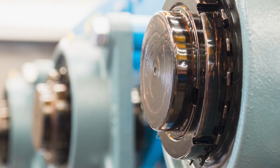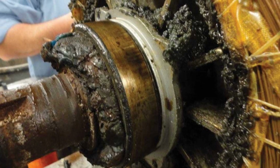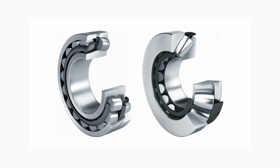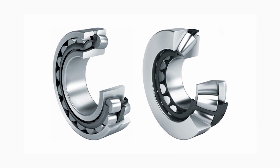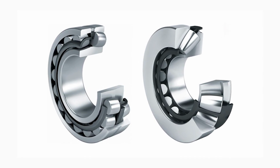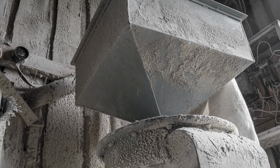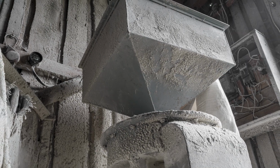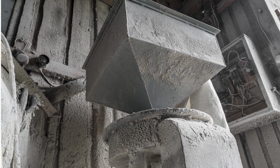Too much lubrication can cause the bearing to churn in the lubricant, and then this generates heat. If we don't have enough lubricant, we can't separate the rolling elements from the outer race, which also generates heat and causes bearing burnup. Now, the OEM should spec in a specific amount of grease you're applying every day, week, month, or year. Sometimes that's not enough. Typically, that's in high contamination areas. If this is the case, we're happy to work with you on figuring out a new lubrication interval.